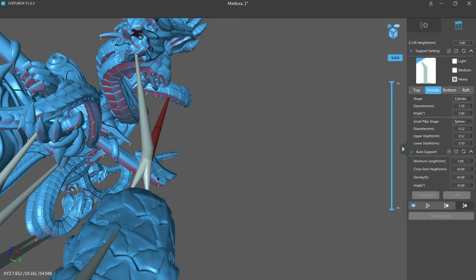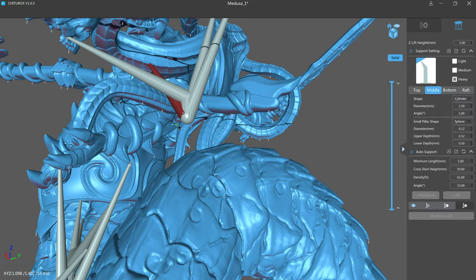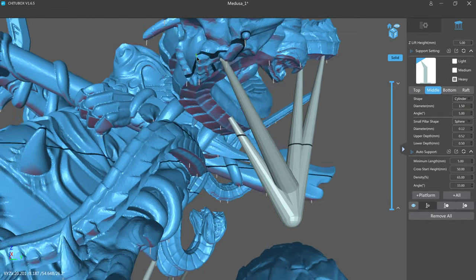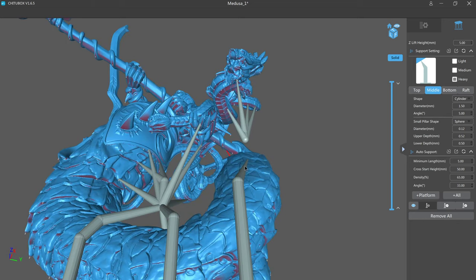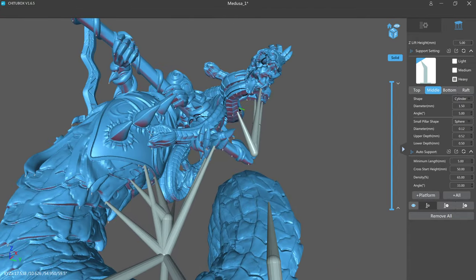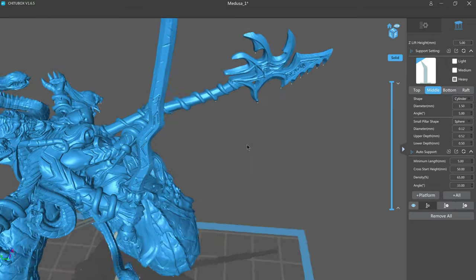And now, let's drop this up here. And you notice you got quite a bit more clearance there. It's still tight, but that's the nature of the beast. That's what this is designed to solve. Normally, these islands up here, this would just be an orientation where I would have to have everything back down over here, and I'd be threading up through here. I'd need to have higher exposures and slower lift speeds. It just makes it a harder print in general. Or I would have to use a different orientation.